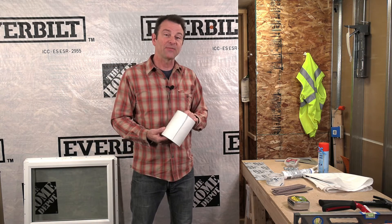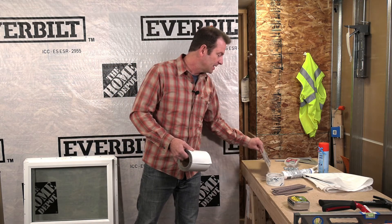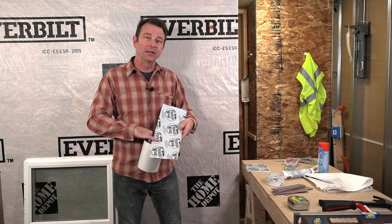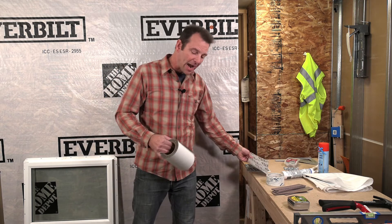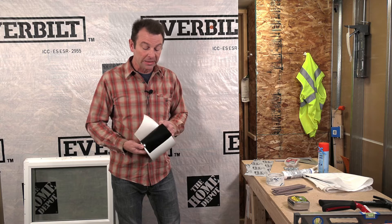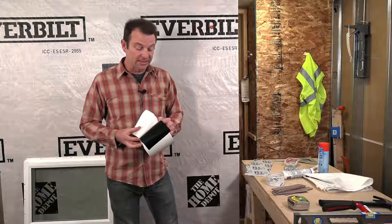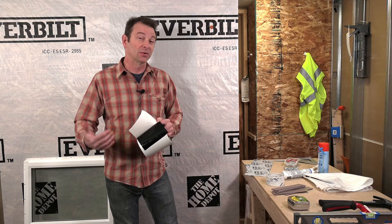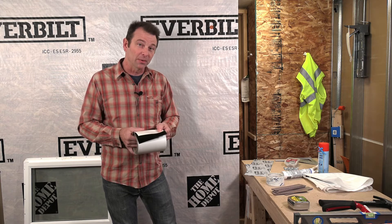My next tape is a very specialized tape. We call this flashing tape, and this is a six-inch flashing tape. It has a plastic film on the outside and then it's backed with a really sticky, gummy material called bitumen — it's black, sort of a tar substance. This stuff will stick like nobody's business and we have to pressure-apply it. With that pressure it's going to stick very well. This will be our waterproofing for a lot of our window, so this is a very important material.